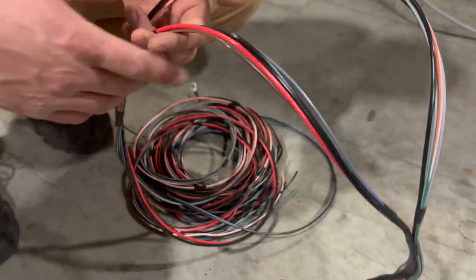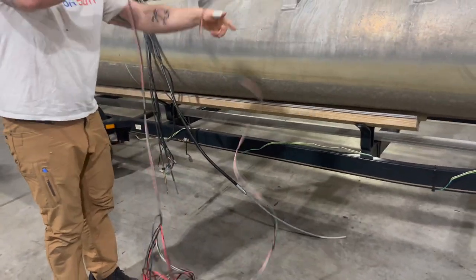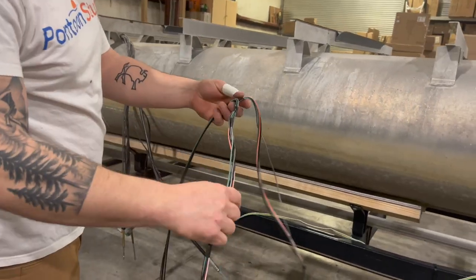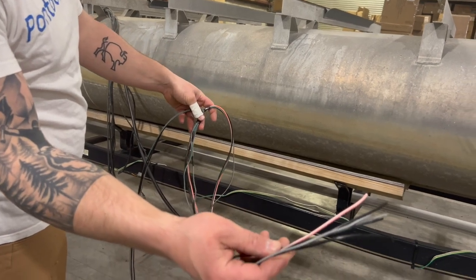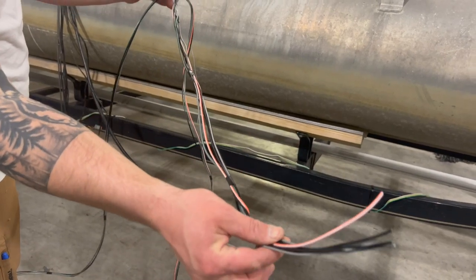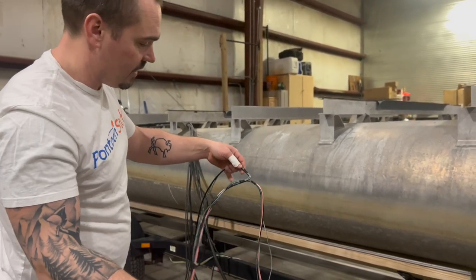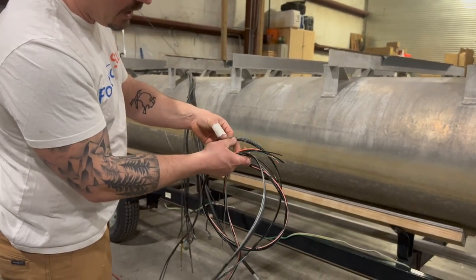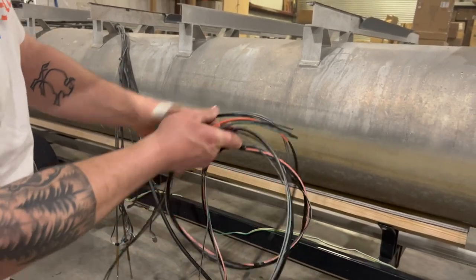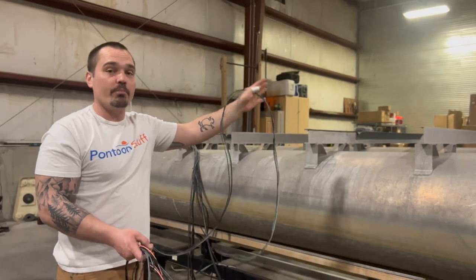With my harness or pigtail pulled, I'm going to go ahead and pull that bundle of wires free. Part of the harness comes to a bundle and splits again. We have a short side with all those same colored wires, but this time with a corresponding black ground wire to each of those — that's going to stay on my starboard or driver's side console side. The other one keeps the same colored wires, drops the horn wire, and we're just going to have navigation and docking lights with a pair of ground wires. That's a longer one so it can extend across the bow of the boat to light the port side.